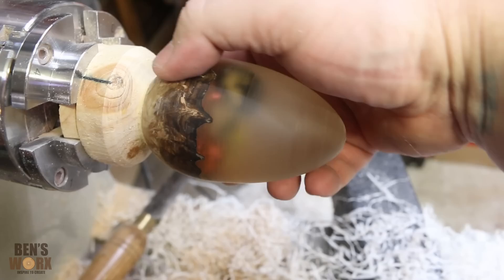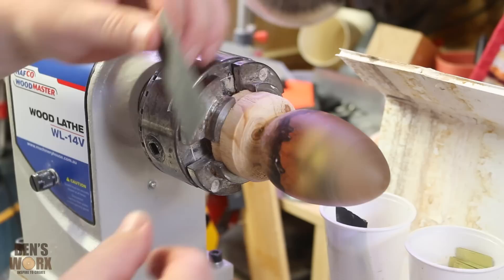I've finished shaping now and I'm quite happy with that shape. The trick to using the skew chisel is just to take your time — you want to get as many tooling marks out as you can, because that will make it easier for our next step, which is sanding. Because the chisel has left a nice finish, I'm able to start sanding at 400 grit, then I'll run 600, 800, and 1200.